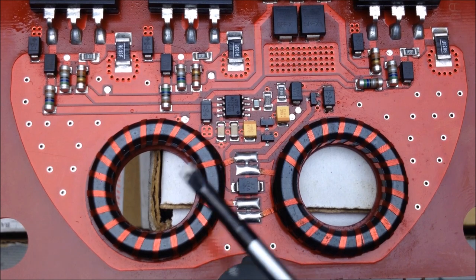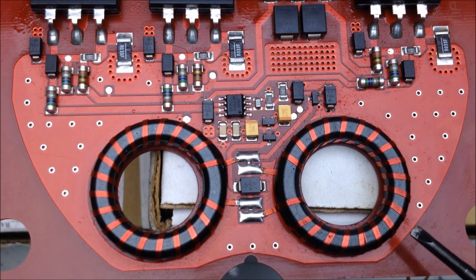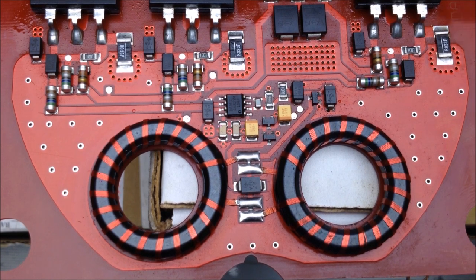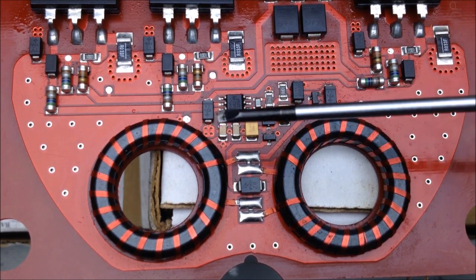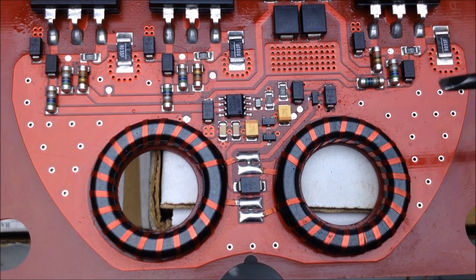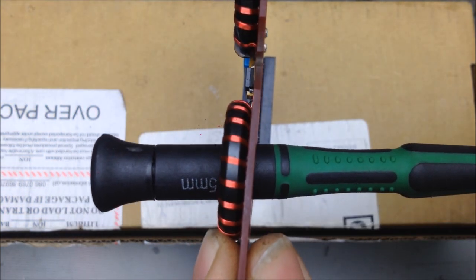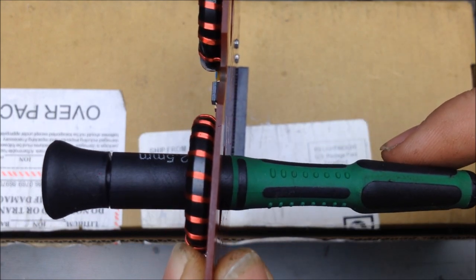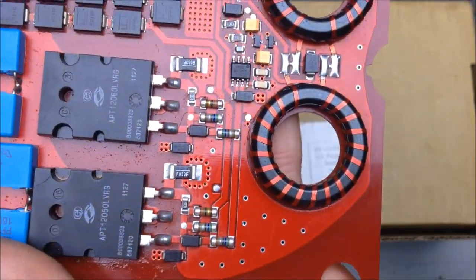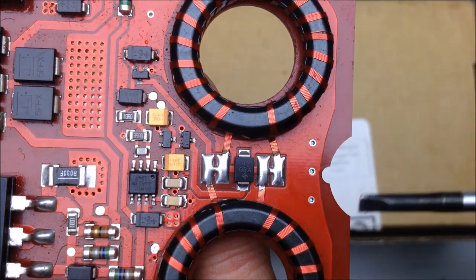Here's the ingenious side of it. We have these two ferrite cores here, and these ferrite cores are remarkably amazing — they can hold a nearly perfect square wave, which is insane if you understand ferrites. These ferrite cores act like the secondary on a transformer. If you know about a CT loop for current measuring alternating current, they use cores similar to this and put the wire through the core to measure the alternating field. So looking from the side, the conductor would go through these ferrite cores. When current is passed through the conductor, a magnetic field is generated. The ferrite material in these magnetic toroids will induce an electrical current to these two coils, and these two coils are in parallel with one another.